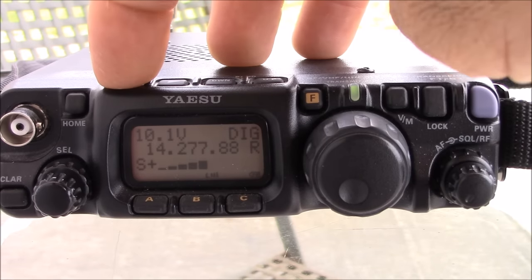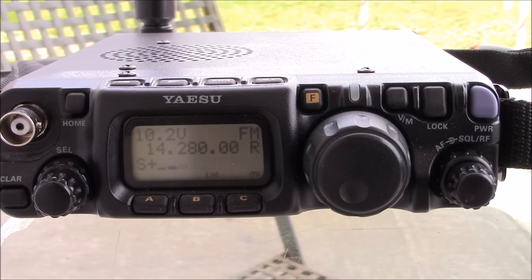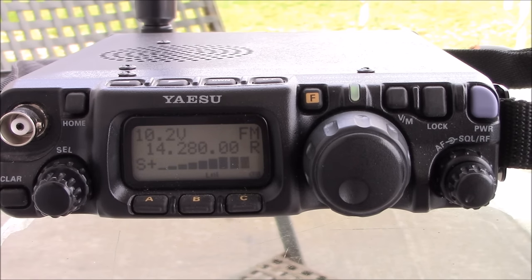Going to FM at 5 watts — you can see there are no SWR bars; the SWR is flat. If I pull the top of the antenna out just a bit, watch how the SWR changes — it goes up. That means the lower portion of the band would have a flat SWR. I push the top back in about 3 inches and it flattens out. That's the best way to get efficiency out of your QRP rig and protect your finals. On 5 watts, the difference between a 3-to-1 SWR and a 1-to-1 is very detrimental — you lose 2 watts and you're effectively running a 3-watt rig.